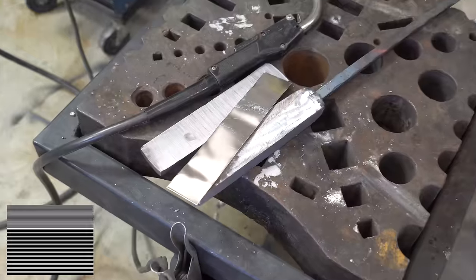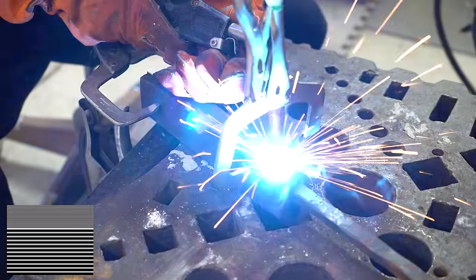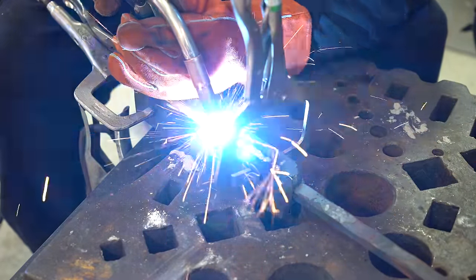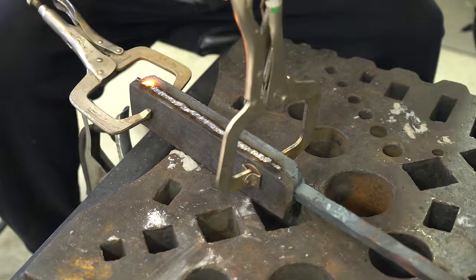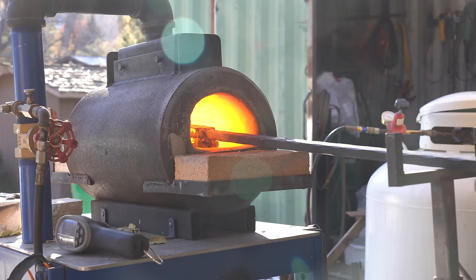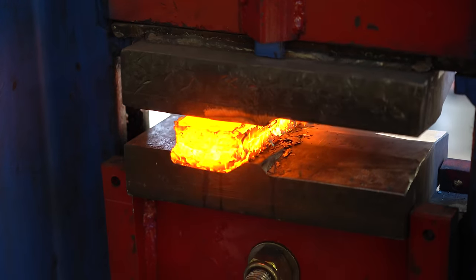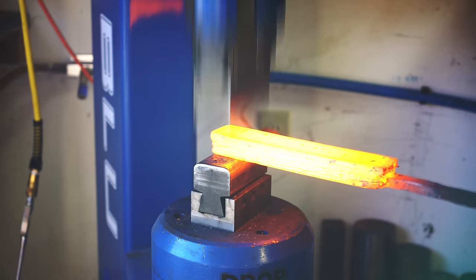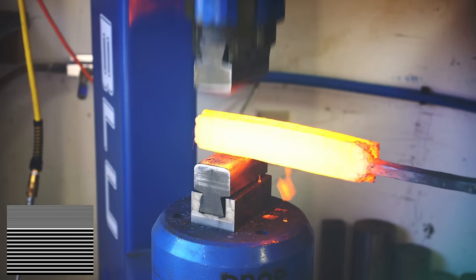Here are all the pieces to our starting billet — my steel, Rick's steel, and a piece of nickel to go in the middle. Looking back, I wish we'd reconsidered welding all the way down the sides, as that gave us a bit of a pain grinding out later. Rick has a 50-ton press that did a good job setting the welds. To draw the billet we moved to the big blue power hammer — Rick gave me a demo; we need to go from this size down to this.